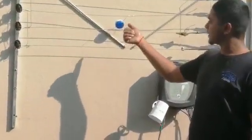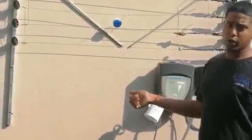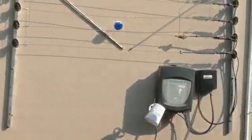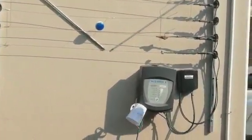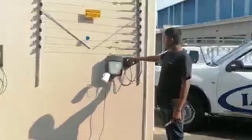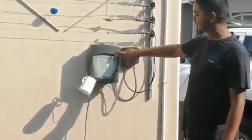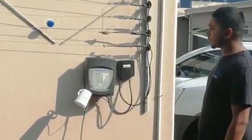You can also add a light indicator — we call it a fence light — that blinks every second as the fence pulses, giving you peace of mind that your fence is on. We also have surge arresters here, which are essential for COC compliance. They protect your fence against lightning and protect your energizer.